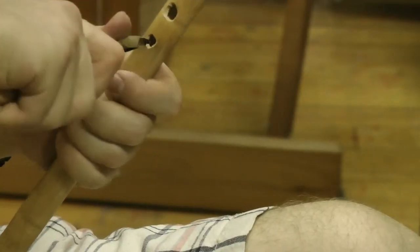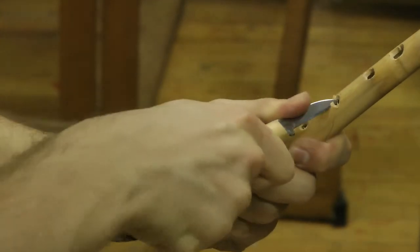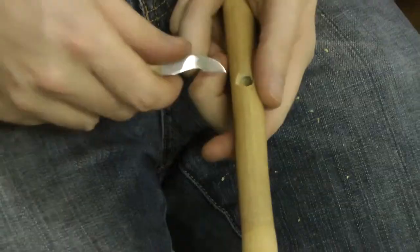If you're cutting bamboo with a sharp knife, this is the technique that works best. Imagine the bamboo with its grains running vertically. If the right hand is the cutting blade and this is the edge of the blade, you want to cut against the side of the grain and scoop up. This way the very tip of the blade makes contact with and cuts the grains. If you do the opposite and cut down into it, the tip of the blade doesn't come into contact until you pivot far enough to the side — at which point the bamboo has already bent, a strand of the grain chips up, and you'll have splitting problems. So you always want to cut in from the side. It'll cut like butter.